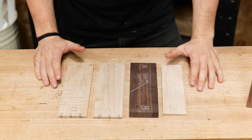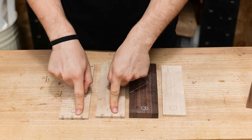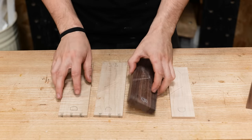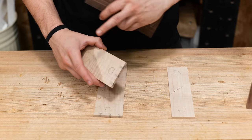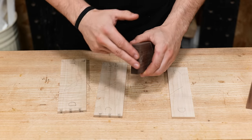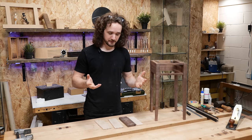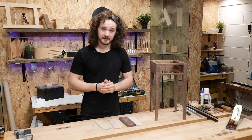Hello and welcome back to the free online woodworking school. In this video we're going to begin cutting the joinery for the drawer that we marked out in the last episode. We've got two sets of lap dovetails to do, two sets of through dovetails nested into a thinner component at the back. We set these tails to sit slightly proud of the drawer front, so when we flush them down we're flushing long grain and not end grain, keeping this drawer front nice and snug. If you've just joined, go check out the last episode. Let's start cutting the joinery.